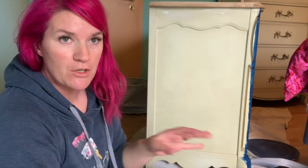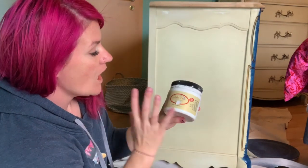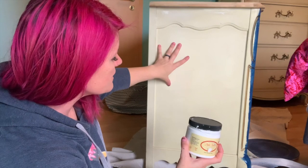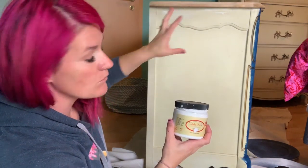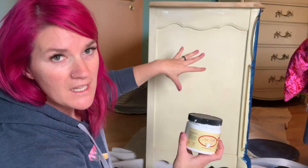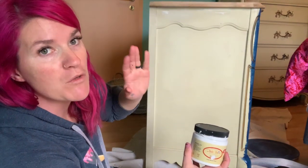I've already cleaned and prepped this piece. The first thing I'm going to do is lay down a base coat. When you are doing this faux denim finish, you want a lighter color underneath. I'm going to use cotton underneath. If it's a lighter piece like this, my coat of cotton doesn't have to completely cover it — it's just so that this lighter color shows through and gives you that denim look. So the first step is to put a lighter color underneath, whether that's cotton, fluff, or drop cloth — you want to stick with the whites. I'm going to do just one coat and assess what it looks like.